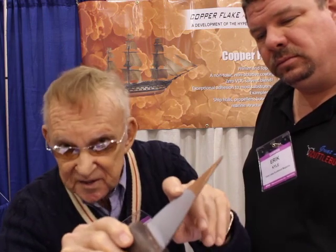Only recently — just a few weeks ago — we've been able to put it in an aerosol can. The market there is huge; it's for the propeller. Currently we have problems painting propellers because most coatings are ablative, and the high turbulent speed of the propeller will throw the coating off. Since this is non-ablative and it's pure copper, it's very effective. However, it requires a primer in order to prevent electrolysis.